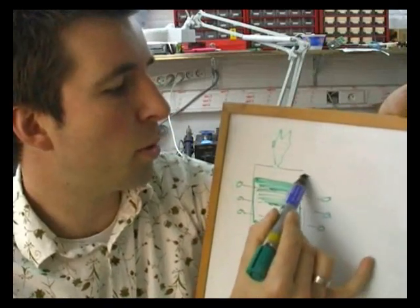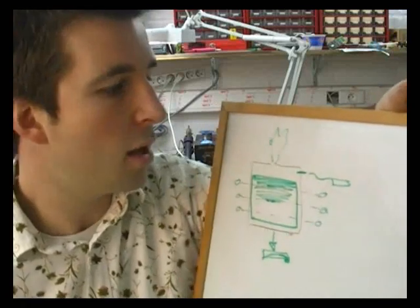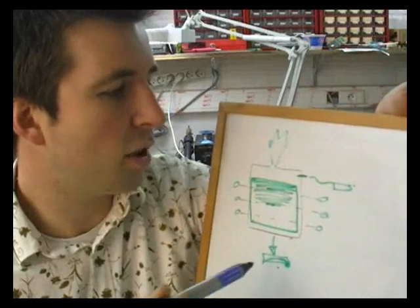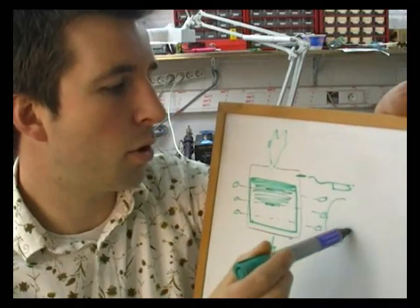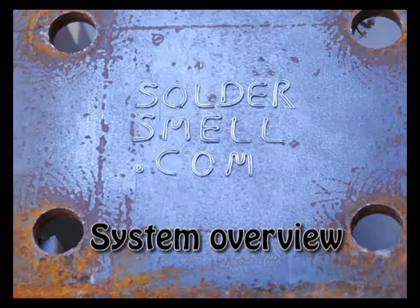We're also going to put a pressure tap with a piece of tube for a pressure transducer on it. So basically we'll be able to measure the pressure, the thrust of the motor, and also the burn rate of the fuel of the motor.